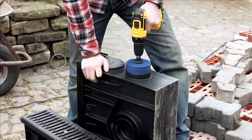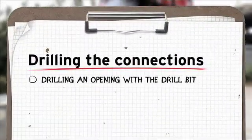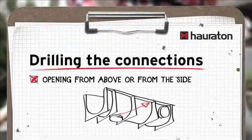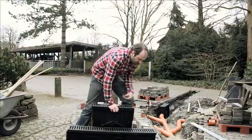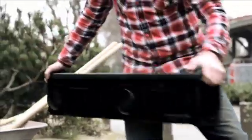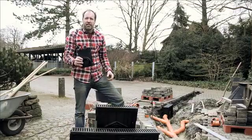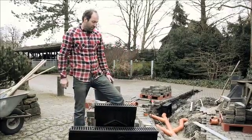The trickiest things are the items that are underground, because they are no longer visible afterwards. The connection has been made. We have now cut the opening. Of course, we could have made them here or at the other side, whichever way was best. With Recifix Pro we can even go directly to the channel from below, from the side if necessary, or above the end caps, as is the case with shallow installation depths — and there we have the pre-shaped cutout. Now we can continue constructing the channel.